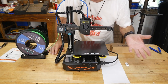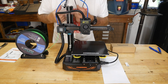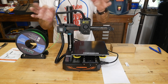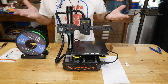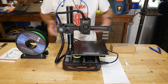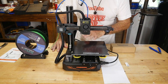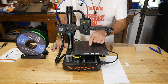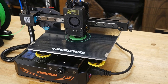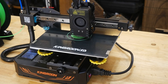There it is assembled — only a couple of minutes later. Put the Z-Rod in first and threaded it up through this piece, then brought it up to where the bearing is. Slid this down into a square hole that's back here, put a couple bolts in there, and also put the bowden tube on. That was it — basically we're up and ready to go. I've selected some green PLA Plus for a project. We'll do the benchy first just to check everything out, then I've got to level the bed yet. Please stay tuned, because I'm going to show you how to get this bed leveled correctly — this is the second one that came in with the same problem, so I'll show you how to get over it.